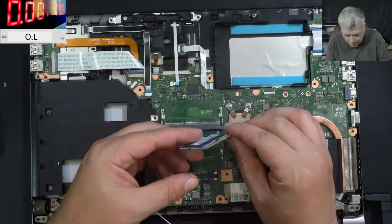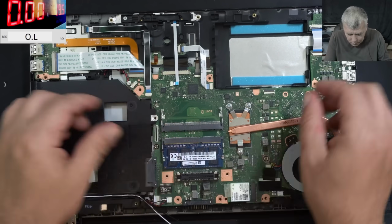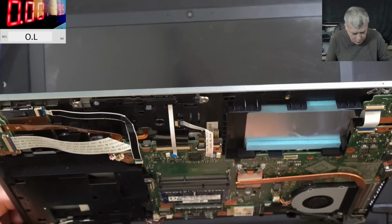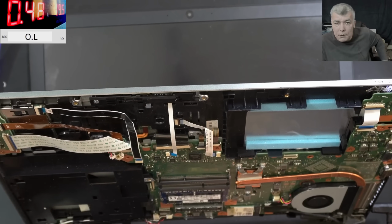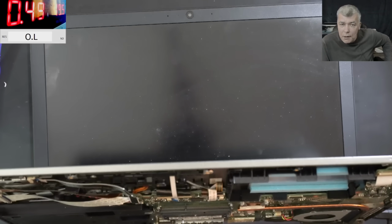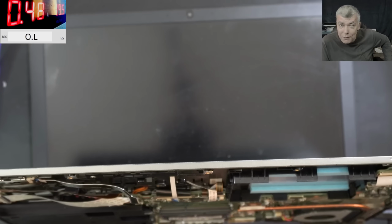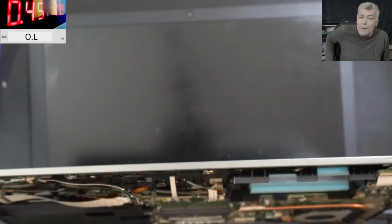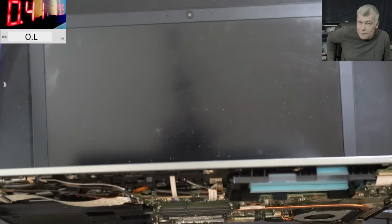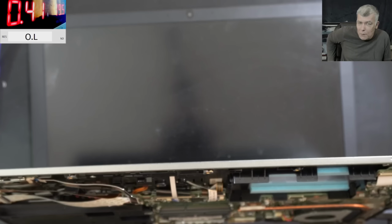RAM memory is looking fine. Yeah, we can plug the RAM memory here. Pressing the power button, it is coming on, and it's taking 480 milliamps. Never seen this current before. 500, check there, 500. Those are good news. Good news. 510. But still no picture.